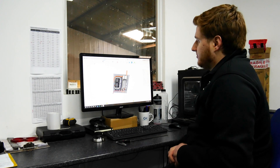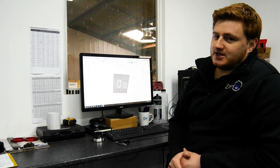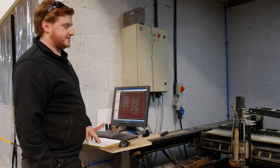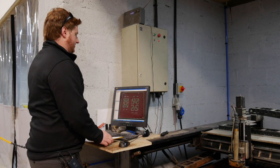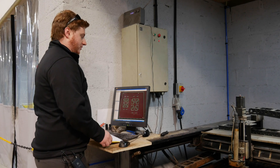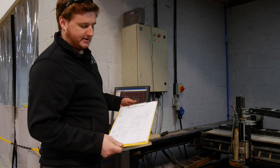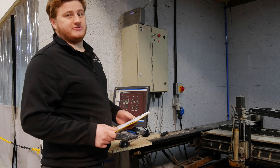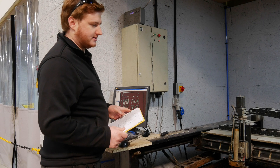We've now done the CAD design for the rear charger and DC-DC plate, so all we've got to do is export the DXF data and take it down to the plasma and start cutting out the metalwork. We're down here at the CNC plasma and I've uploaded our DXF files into our sheet metal cutting program. We're going to generate a toolpath so the plasma knows where it's got to cut. I've also printed out all our engineering drawings so when it comes to assembly and welding I know exactly where to weld, where to fold, and what to bend, which makes everything a lot easier. Now we'll just get to cutting and cut these parts out.